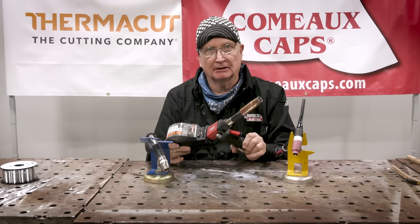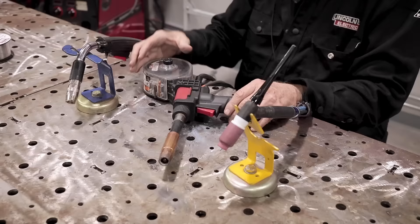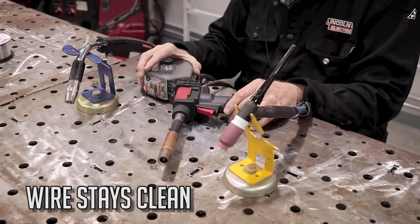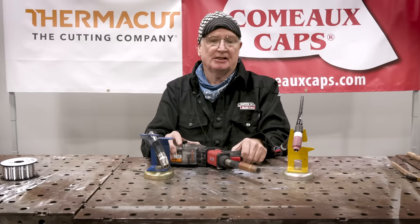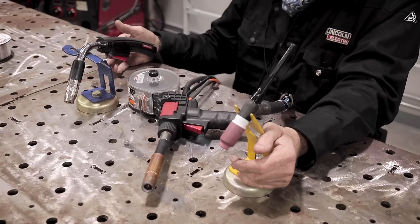Let's talk about why you'd want to use a spool gun instead of a TIG torch or a MIG gun. It's big and bulky, but there are a bunch of reasons why you'd want to use one. It's got self-contained wire that stays clean inside, and it's inexpensive to replace. You've got a 25-foot lead, which allows you to get far away from the machine or get around complex things like a boat, trailer, big frames, or even structural things.